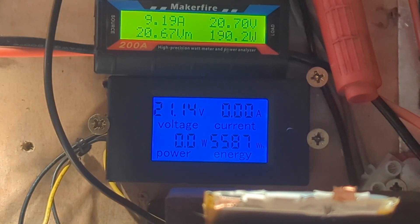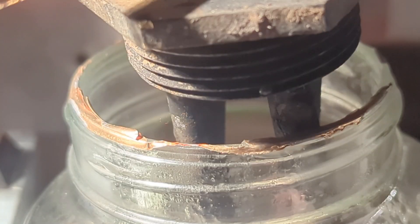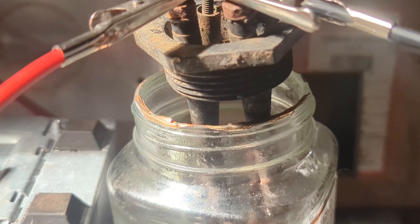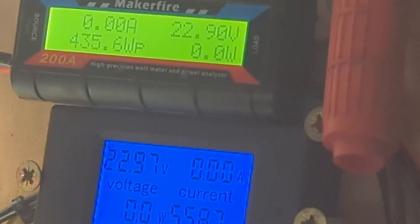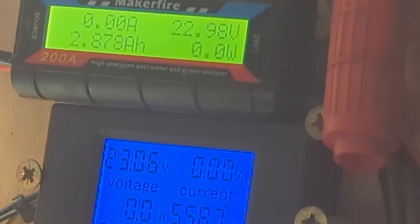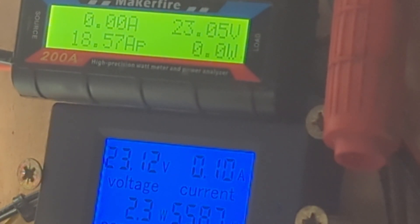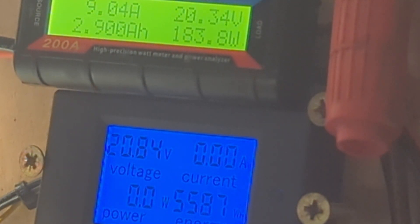It's about an hour later. I've come back out to stick it on again, but there's not enough wind. It's 100% on the speed controller. It's actually stayed really warm — it's 13 degrees centigrade here at the moment. The wind's just died. It makes that winding noise at the exact point where it'll start hitting 23 volts, and then once it's one or two volts over, there's not much sound apart from the blades wishing. We're in the juice — I'm going to stick it straight in at 100 to see if the turbine does anything other than stop.